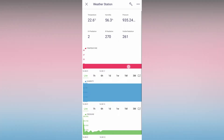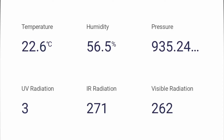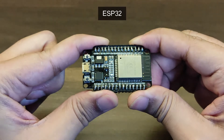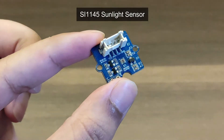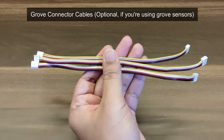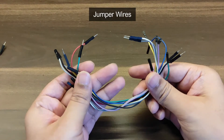This is a good project to get started with IoT. The code and setup part is just a bit lengthy, so watch the video carefully till the end to make sure everything works. Here's what you will need: an ESP32, a temperature and humidity sensor which can be DHT11, 21, or 22, an SI1145 sunlight sensor, a BMP180 pressure sensor. I used Grove sensors, so I needed Grove connector cables and jumper wires.